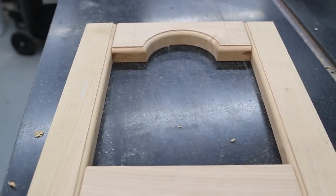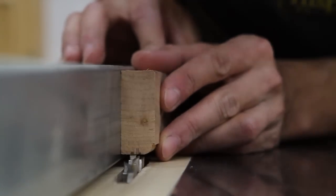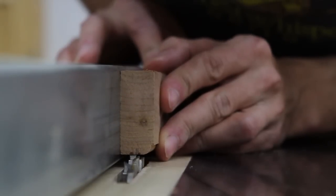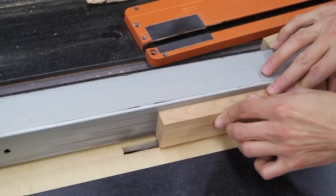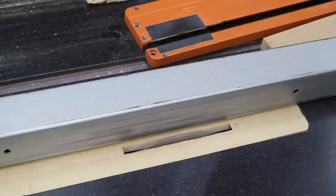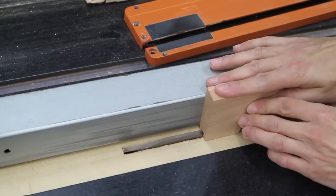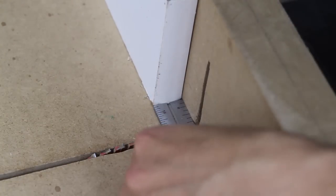Here's how all the pieces look after receiving the bead. Next I'll put a quarter-inch dado into my table saw to start cutting the grooves in all the pieces. Since we want the groove to be centered, a way to speed up the setup is to add a center line to your piece and line it up between the two halves of the dado stack. Once I get the saw set up, I'll run a test piece through to confirm my setting, and then run my pieces. To ensure the groove is centered, I'll run the pieces twice through the saw — once with each face against the fence.